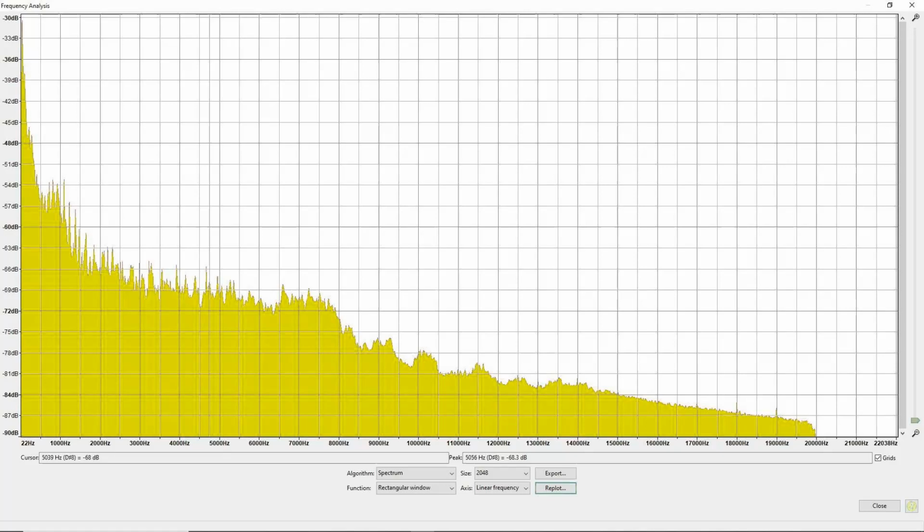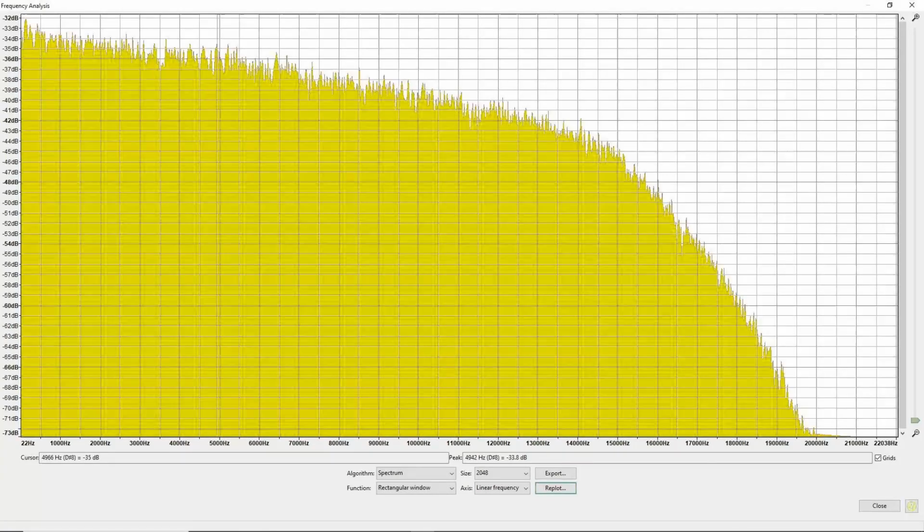So again, a good rendition of that tune. Looking at the trace, you can see how it hasn't got the knee as it goes off. So that means it descends into the mush, which is the hiss. But it's important that you should look at the actual levels. However, the fidelity of that tune is far better when it's within the minus 20 dB playback. It is proving to be that way on all of the tapes so far.